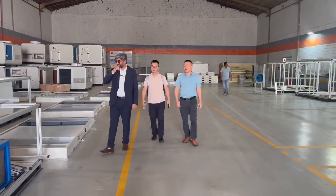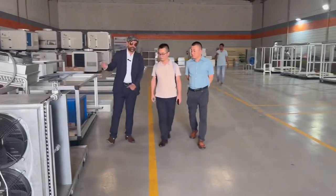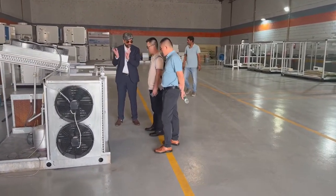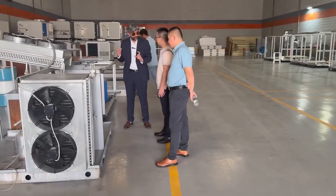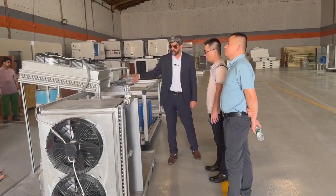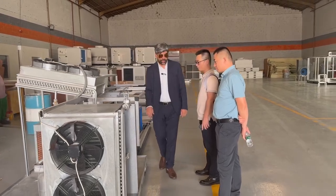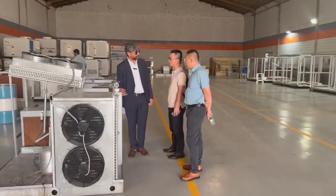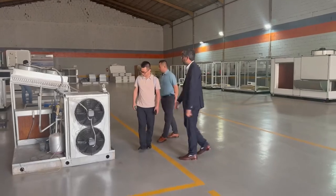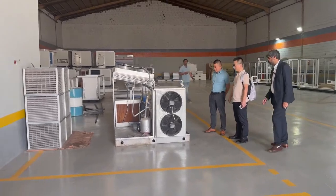This one will be ecology unit, and this is what we are going to do a new experiment. With the heat of sun, we will make AC. Not like solar, heat of the sun. So there will be glass tubes. It will heat the water up to 80 degree, and this 80 degree water will circulate. From one side it will give heat, another side it will give you the cooling, like absorption or like with ammonia and lithium bromide. This is we are making experiment.